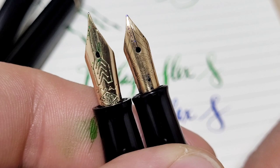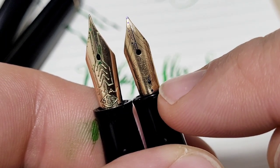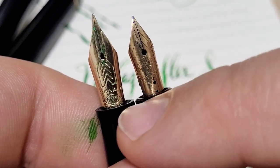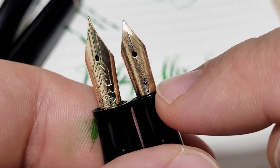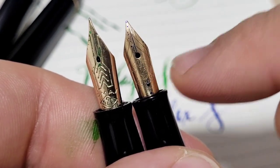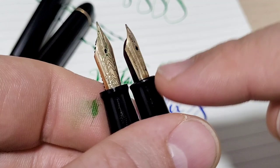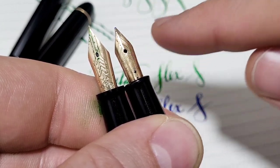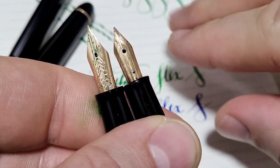Here are the two nibs close up for comparison. One thing to notice is with vintage pens, flex nibs rarely have higher than 14 carat gold — and that has to do with the properties of metal and the proper tempering you need. You have to have other metals in there to get the right alloy so you can form the nib the way you want, but also so it has the right springiness. You might think the higher the gold the better, especially for flex, but that's not necessarily correct. 24 carat gold would be too soft — it wouldn't have that bounce, that snapback. You need other metals mixed with the gold to get those properties.